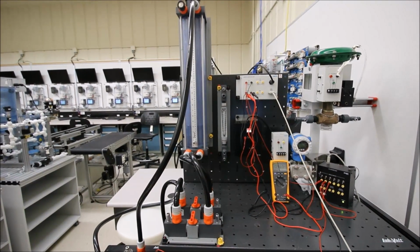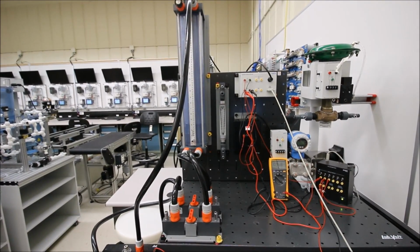So I've got to actually bring the level up to the 50% set point, to match with my set point. If I start at 0 and then try to have the computer take over, it's too much. I need to set up my actual level at 50%, matching with my set point, and then it'll be a lot easier for my computer to take over and have my set point and my control variable matching with my PID settings.